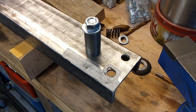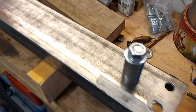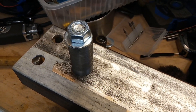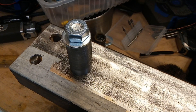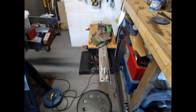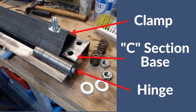Here you can see the initial layout of the C-section beam. You can see some masking tape marked up with the position where the hinge will be. This also shows the bolts that will retain the spring and the lift mechanism for the angle iron clamp. I used the method of bolting the bolt in place with a piece of tube so that I can weld it from the other side — because the tube is cut square, it holds the bolt really nice and perpendicular to the metal. Next, I had some rather long cuts to do: 120mm in length through steel that was either 8mm or 6mm thick, with four cuts in the angle iron clamp and four in the C-section main beam.